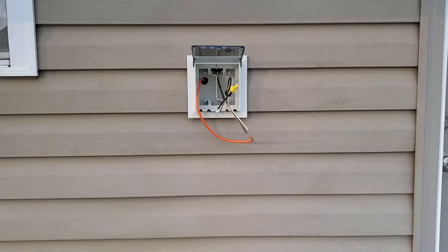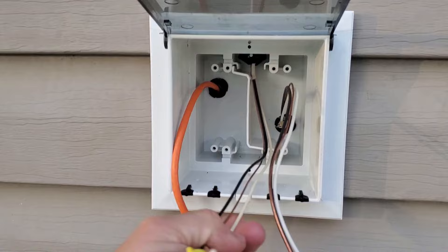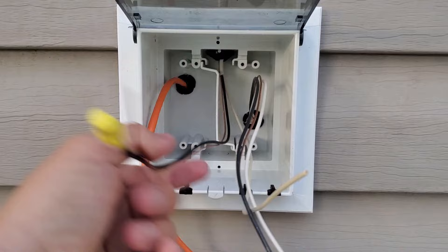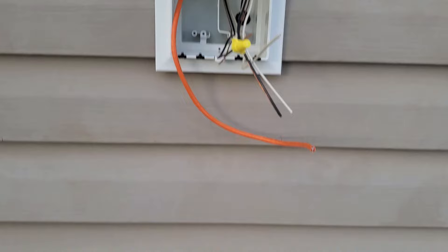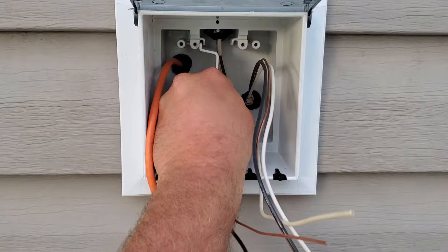Clearly I'm not one to leave well enough alone. The rain finally pushed out of here after a couple of hours and there's still some light left, so I thought I'd quickly go over the box we have installed for the TV. We've got 14-2 Romex coming in and Cat6 as described. I told you before we're feeding that off the receptacle below, which is already GFCI protected because it's fed from the exterior GFCI on the other side of the house — which means we don't have to put a GFCI receptacle in here.